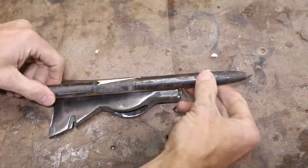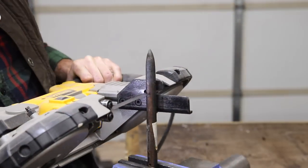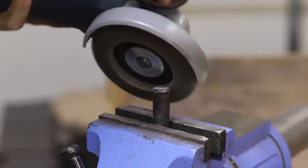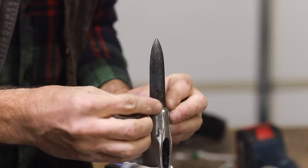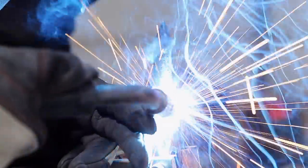To add the spike, I'm using a steel stake I got at Home Depot in the concrete section — these are used to stake in concrete forms and you can pick them up for super cheap. After cutting off the end, I added a chamfer to the bottom to get a better weld when I connect it to the axe. In addition to attaching the spike, I used the weld beads to build up material that I could blend into the axe head. I also filled in the nail puller on the side of the axe head.